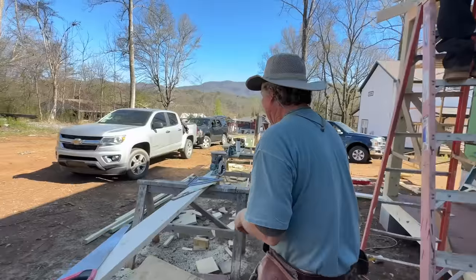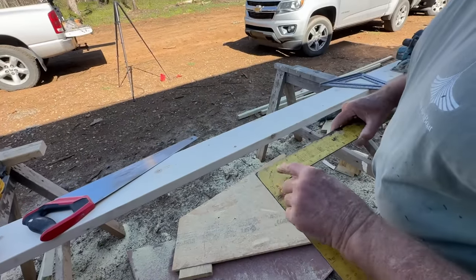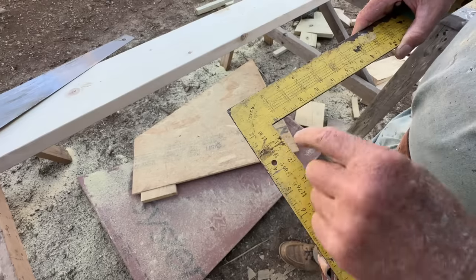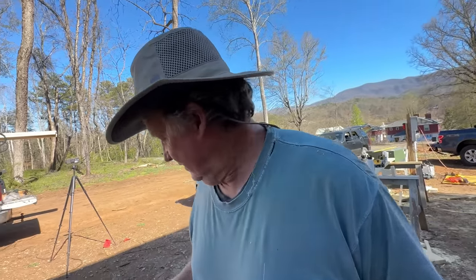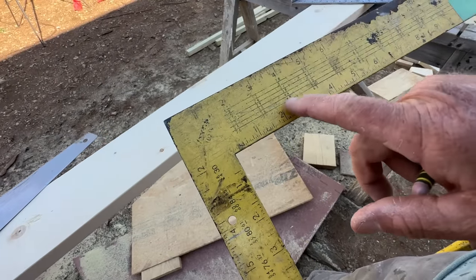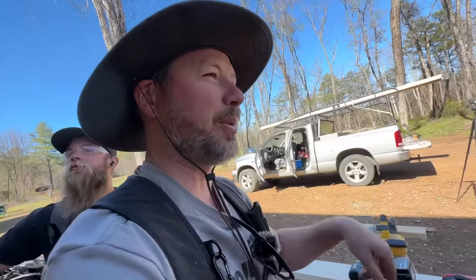This square is no good because I can't read which one it is, but if you can pick up the 4/12 on a framing square it will tell you on a common rafter what the length is between those points and you can just measure it out instead of having to step across the way I did. You can do it on hips and valleys too — that's what those numbers are for. Whatever pitch you need, just go to 4/12, or 5/12, 6/12, all the way up. We don't even need tapes anymore, except to measure between those marks.